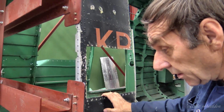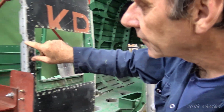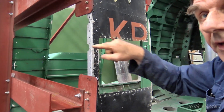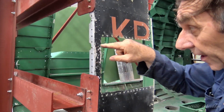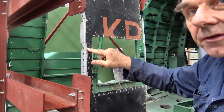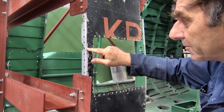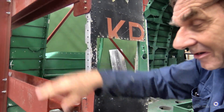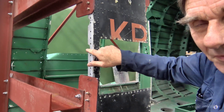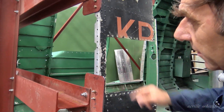Why is it fine when it goes straight to the rivet hole? For a crack in a piece of metal, you actually drill the end of the hole to stop it cracking any further. If it goes to a rivet hole, it can't go any further — it won't carry on. If it comes to a hole it can't progress. That wouldn't be any good for flying, but it's strong enough.